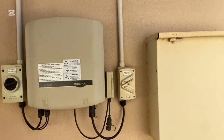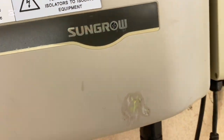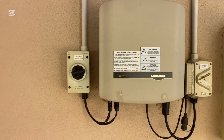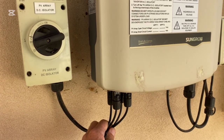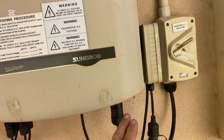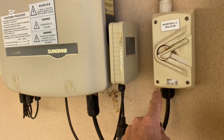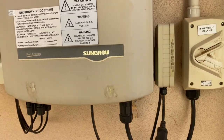Still in York — I'm in the town site now, just having a look at this SunGrow inverter. It's coming up with error code 38, which, if you do a Google search, indicates an earth insulation resistance fault. I've checked all my DC voltages and insulation resistance — they're all good. Short circuit current's all good. And now I've checked the AC, and if I disconnect the earth from the inverter to the main earth, I do get around 116 volts between the two, which tells me the inverter is faulty.